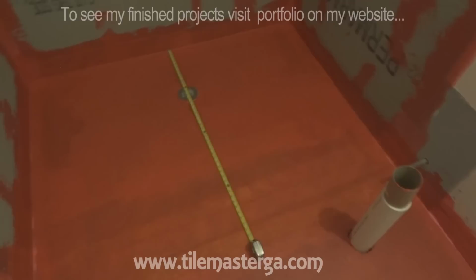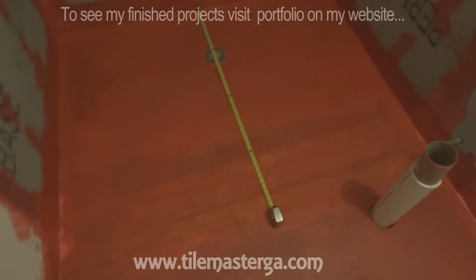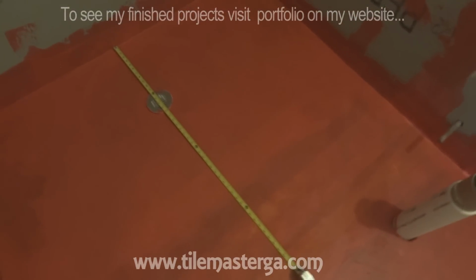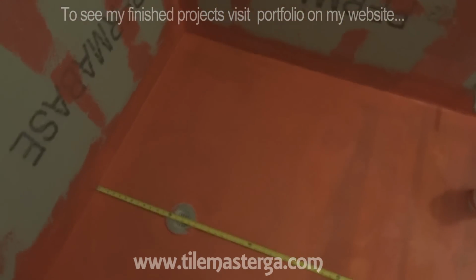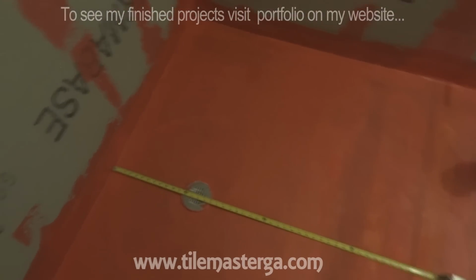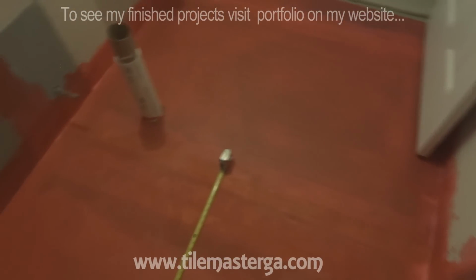Another day on our project. We've been doing the final waterproofing yesterday. We're back today, everything is dry, the light pink color of Red Guard turned to darker red, which is the way it reacts when it dries. And the very next step will be to, of course, start tiling.